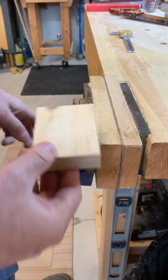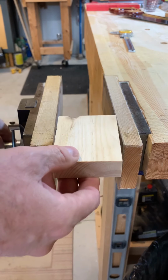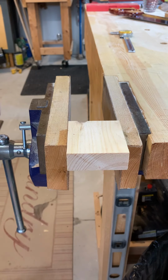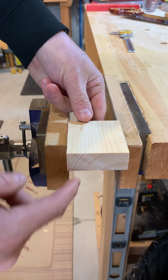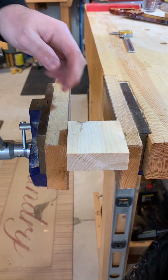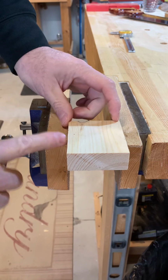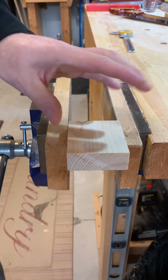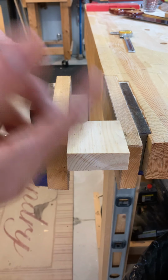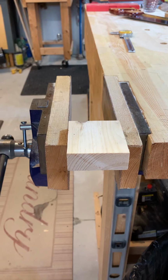So first off, you'll also notice that my vise is not the same as the vise you're going to use in the shop, but the same principles apply. You're going to grab the aluminum block, pretend this is aluminum, not the wood, and clamp it in the vise so it's like this. So you have it raised above the jaws and hanging out on the one end. That's going to allow you to do setup, draw a line, mark it, and cut it without having to clamp in the vise, take it back and forth in another vise.